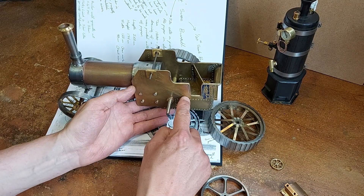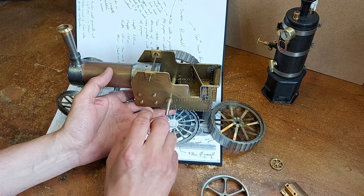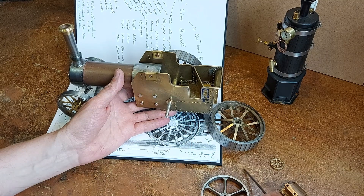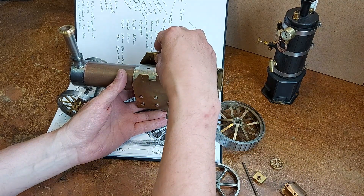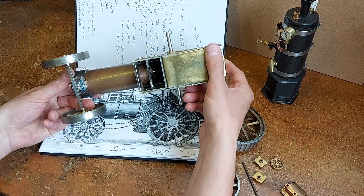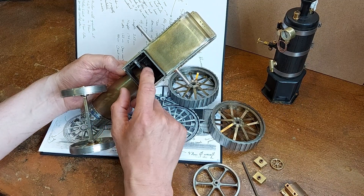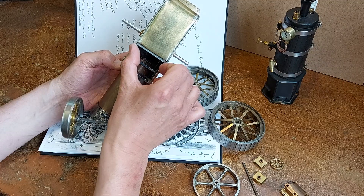The main tub of the engine is brass — I've made it all in one piece. The firebox itself is a steel construction with the boiler pushed into it. The flywheel is made from a solid piece of cast iron, machined up. Turning it over, you can see the underside of the firebox and the boiler. The boiler sits and pushes into the firebox — it's a cylindrical boiler with seven flues that will be silver soldered into place.